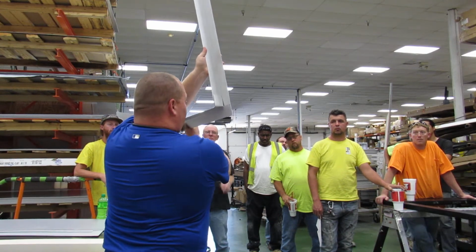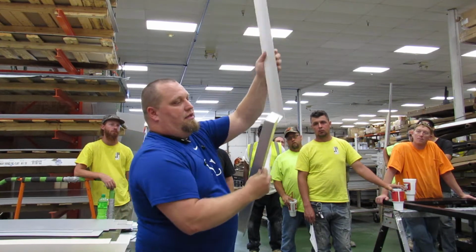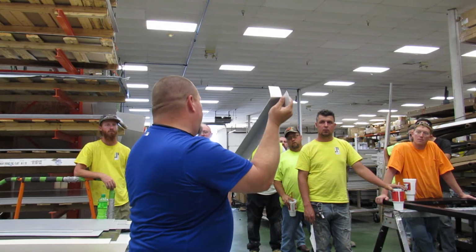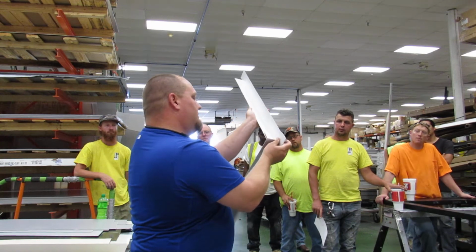So that any water that runs down that, you still have a shingle effect. If you don't have this tab here, you're putting this over it and you just have a corner right here at the bottom that's a weak spot. As soon as that caulk fails, it's going to come right in, you're inside the systems. You have to do these laps.